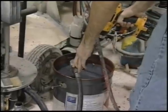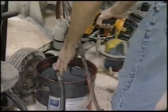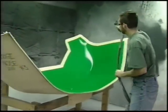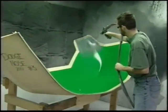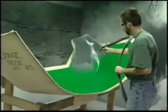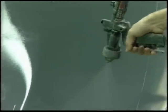The Duratec polyester primer should be thoroughly mixed in the can prior to catalyzing at two percent by volume with standard full-strength MEKP catalyst, and this is best done with a machine mixer. The Duratec primer is easy to apply — spray, brush, or roll it onto the mold surface as you would a gel coat. As you watch, the process may look familiar, especially if you work with gel coating, and it should, because the process is the same.